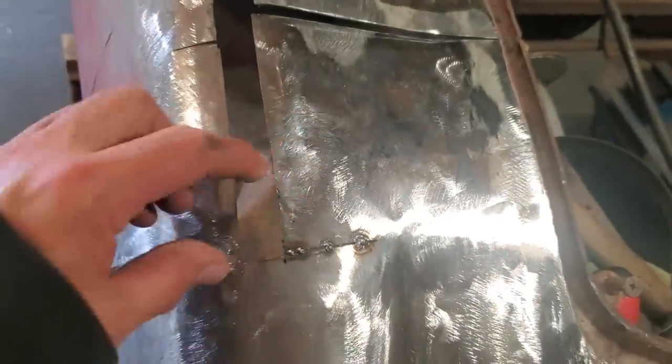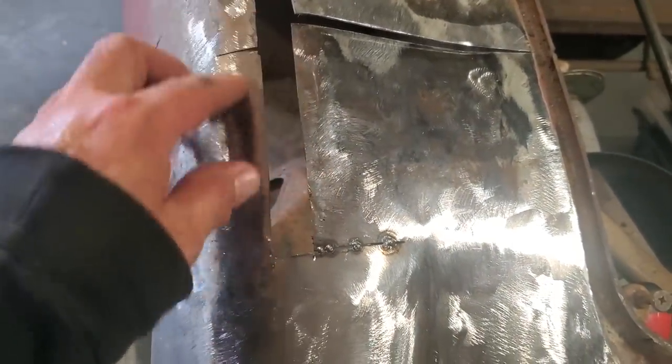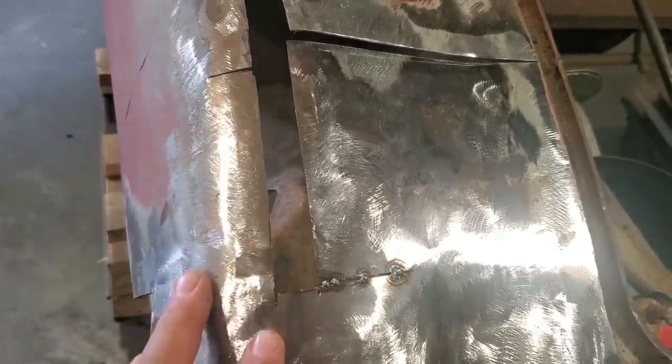So what I'm going to do, I got this down here pretty close to where I want it. I'm going to make up a strip and I'll put it in here. I'm going to start from here and work my way back up across the panel. I'm going to make a piece up here that I can overlap here, and I'm just going to cut and butt right into that there. Just a flat piece. I might put a small crown on it. I don't know yet, because it's just the transition rolls over the top side here.